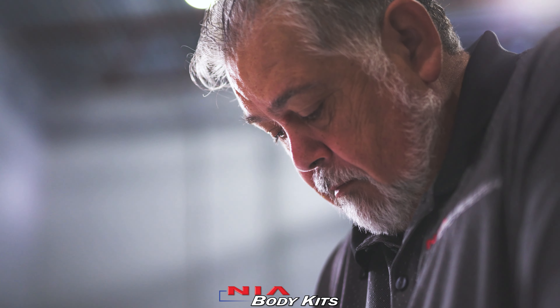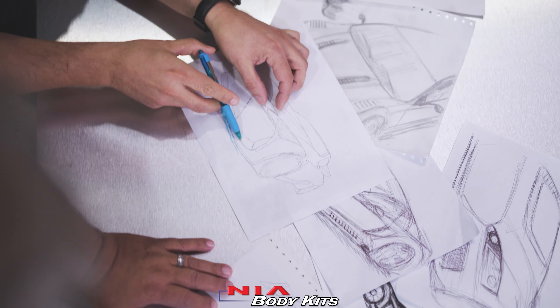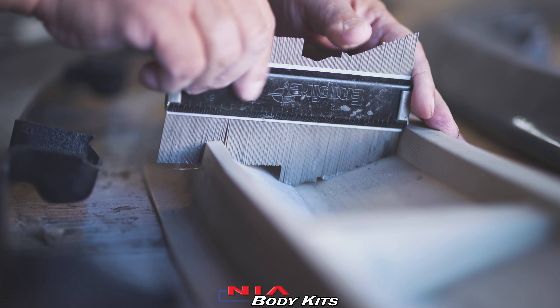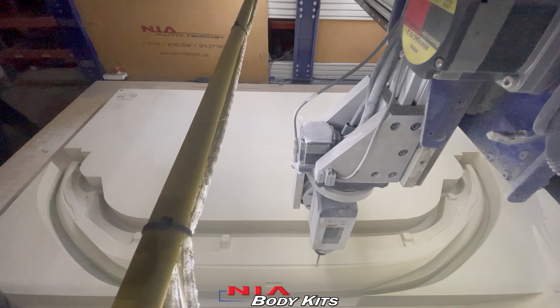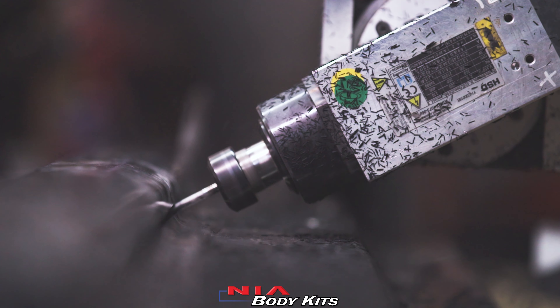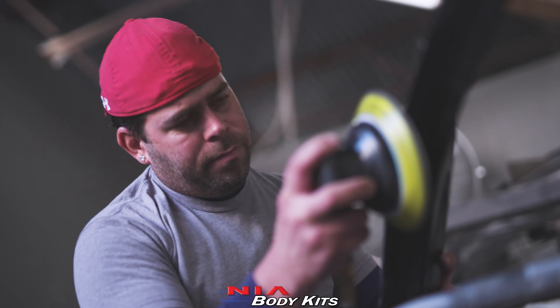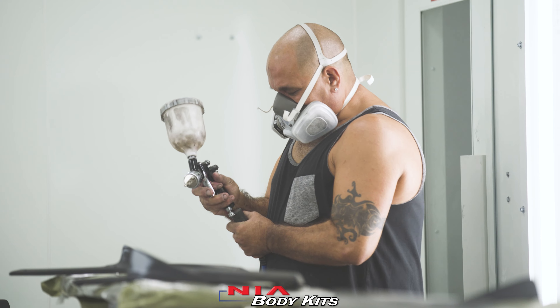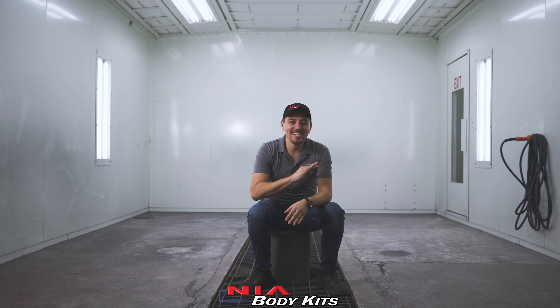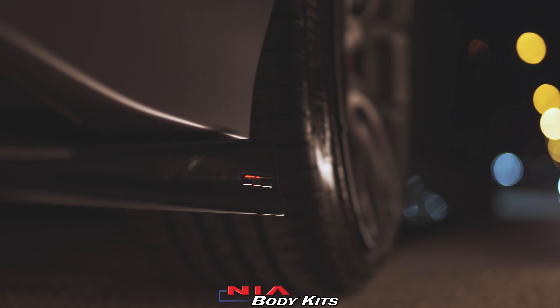When we come up with a new design, I'll sketch it out with Avril — he helps me because he's a better sketch artist than me. We'll present the sketch to William. William will do everything in 3D. Once everything's good, we commit to a mold. The mold goes onto the vacuum forming machine to make the piece, and after that it goes into the CNC — it uses the 3-axis to make the mold and then the 5-axis to trim the pieces. From there it goes into production: they sand everything down, make sure everything's perfect. If the customer wanted it painted, we color match it and paint it. Then quality control — our guys find every speck of dirt, wet sand it, buff it, make sure everything is perfect before boxing it up and shipping out to the customer.